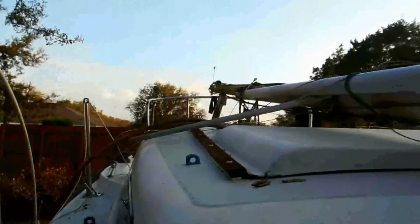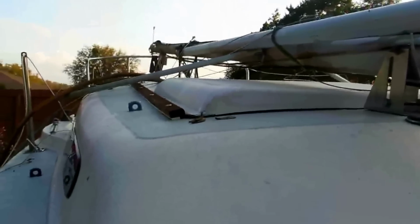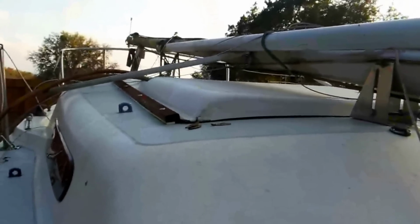You can see the coaxial cables coming up through right there, see? So I can actually plug it in right there. Just disconnect that or disconnect it down there on the bottom. And even if you use a length of coaxial cable, I can run it inside the house and use the CB antenna with this mast up in the air. And you got some pretty good transmitting power. That's one of the things, you got to get enough height to get up around these trees and stuff like that, and buildings. You get a hell of a lot more range. So it's good to have extra stuff around because you never know when you need it.